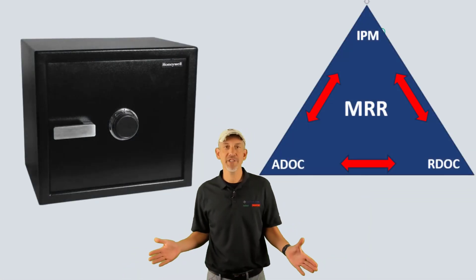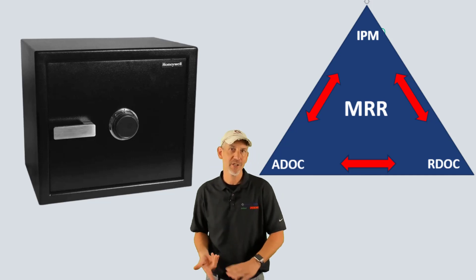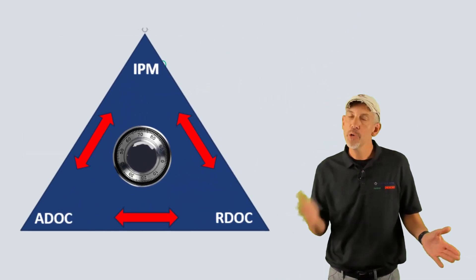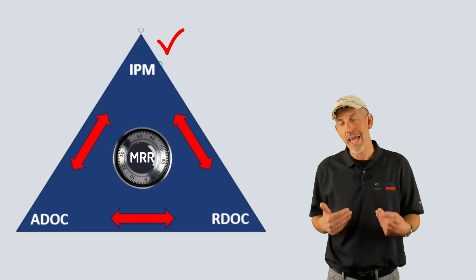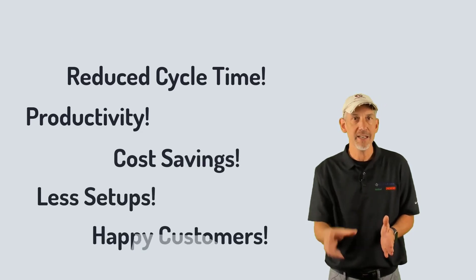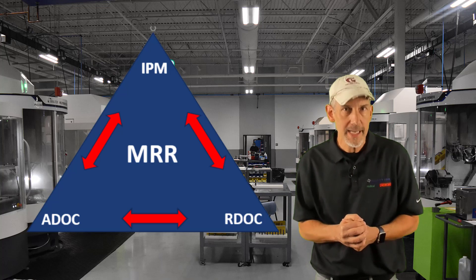Think of this as a combination for a safe. In order to get the goodies inside, you've got three numbers you have to hit right — you need all three to get in. That's exactly what I'm doing with the MRR triangle: finding the combination. The big factor is that I can use my RPM — which brings in heat — as an ace in the hole. Even though we have three things (inches per minute, radial, and axial), RPM is controlling my inches per minute, so it's a big X factor. When you start getting a little slow, you can use RPM to boost back up, as long as you're within the range that cutting tool can handle. Use all three things on the MRR triangle to find that combination, identify what's causing the most problems, and fix it.